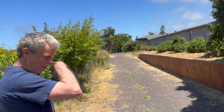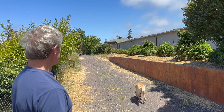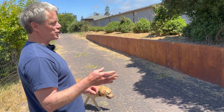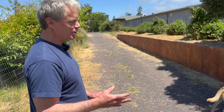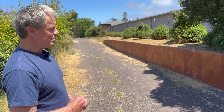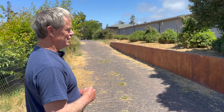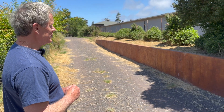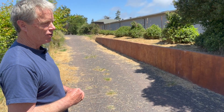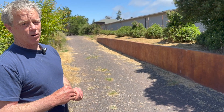The retaining wall is about three and a half feet tall — a little taller because we had to put in some rock after we built it. It does not have any control joints — that wasn't the plan, but things didn't go according to plan since the concrete was way too wet and we didn't have a good 3D admix at the time. It's 90 feet long and we did get some cracking because of no control joints, but you'd be hard pressed to find any right now. The 3D admix does seem to reduce cracking, particularly early plastic shrinkage cracking.